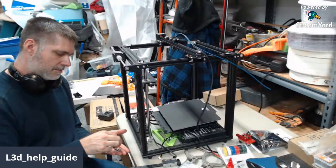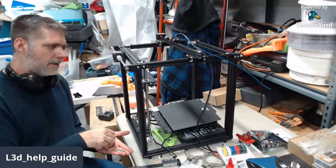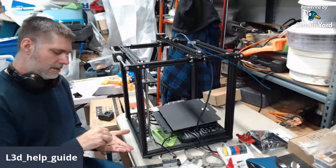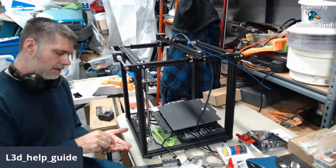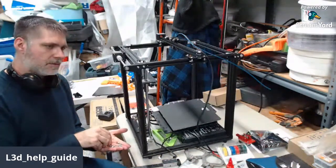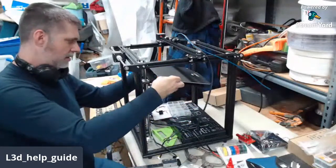I understand their use from my machining days. Getting rid of backlash was a preferable thing. In this particular case, or actually in all of the 3D printing space, there's enough gravity weight holding the machines, and once we start printing, we're only traveling in one direction unless you do Z-hop. So it doesn't need to have that backlash regulated so tightly. And even if you're doing Z-hop, doing what I'm doing right now will not cause you problems with moving up and down. So there's that. So that's my 2 bits on those.